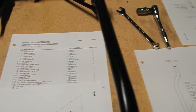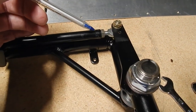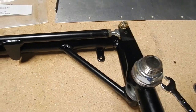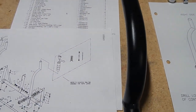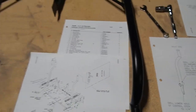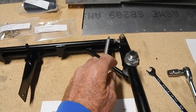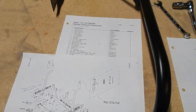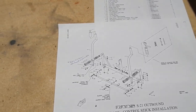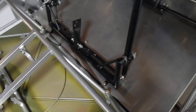The other thing is to make sure that the control sticks are parallel - that all depends on how far you screw the tube in. You use Loctite blue and a nut. I measured across the bottom and then across the top to make sure they're the same, adjusted until parallel, then measured the turns. You need at least 10 turns, but I needed more like 15 to 20 to get them parallel.